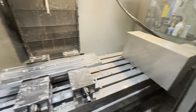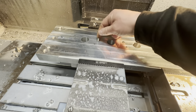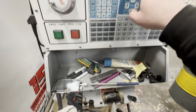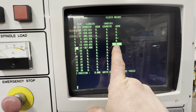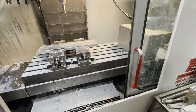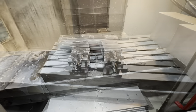Here are some 8mm dowel pins. I actually set this to 'wear' in the control, which I don't normally use, so I hoped it hadn't gone too big straight off the bat — and it hasn't; it's slightly undersized, which is perfect. It seems if you put it in Fusion 360 as in-control it goes bang on every time, but if you set it to wear so you can adjust via offsets, and there's nothing in the wear offset, it always comes out undersized. That's actually good because you can creep up on the diameter rather than going oversize.